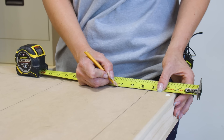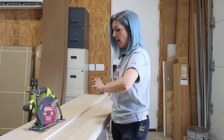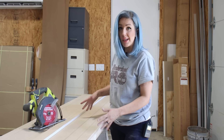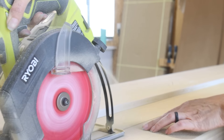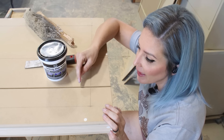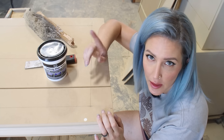I've marked out where the mirror will be centered on the door and also the location for the handle. I need to cut a 1/8-inch wide, 1/4-inch deep groove in the face of the door to accommodate the long flat handle inset. I'd typically use a router, but I don't have an 1/8-inch router bit, so I'm just going to use a circular saw and make a couple of passes. The circular saw blade is round, so I couldn't stop exactly at my line for a clean channel — I needed to extend the groove all the way to the end of the door. It's not a big deal since I'll be skinning the face of the door with hardboard anyway, and I'll use premium wood filler from DAP to fill in the groove so it's a flat surface.